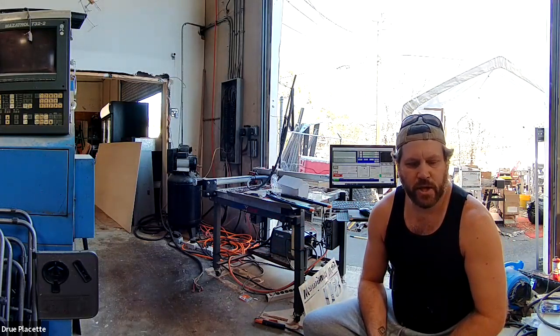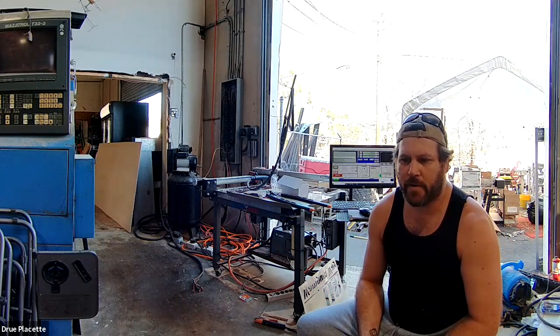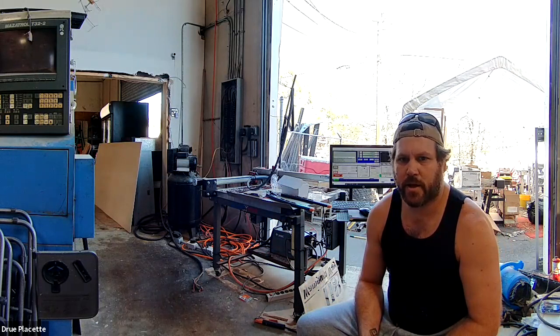And the thing with yours too was, with this one, you don't really have much control over anything. You can put different torches on there. You can pick your own plasma torches, but they're very limited because they had some issues with their controller where it's not grounded well. So some of the electronic torches cause interference with electronics in the control system, and so it screws up. There's only a few torches you can actually use safely without frying everything.